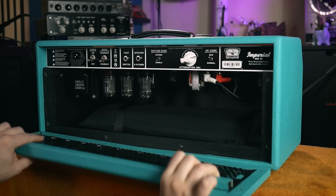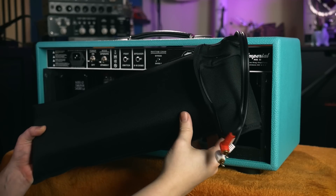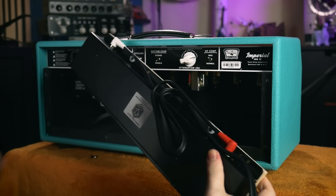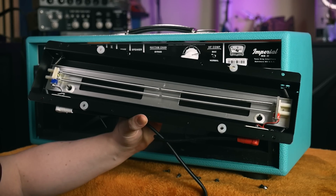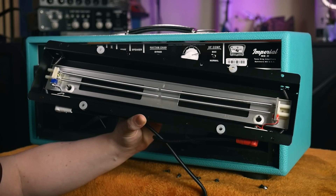I love spring reverb, always have, but I came to the realisation recently that I've been — not wrong, but perhaps ignorant of how some other people use the effect. My exposure to spring reverb comes from having a spring tank hidden somewhere inside an amplifier. These built-in spring reverbs are placed after the preamp and tone stack in the circuit and are mixed in fairly conservatively. Even at their most extreme settings, they never overtake the sound.